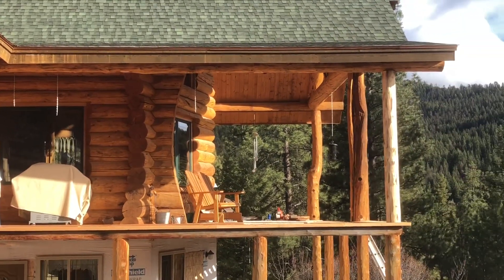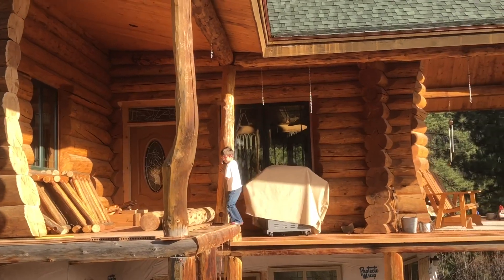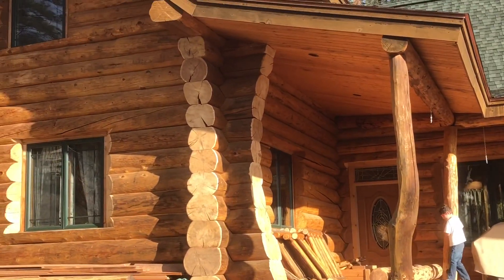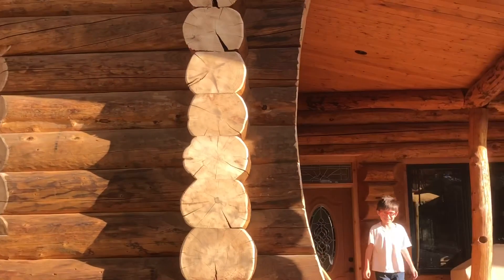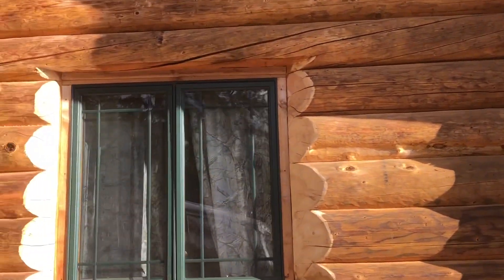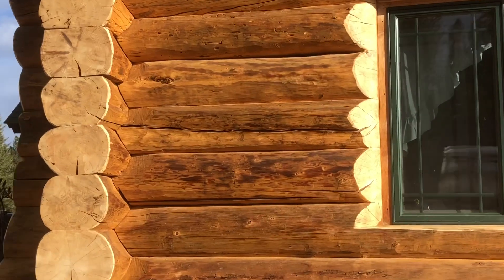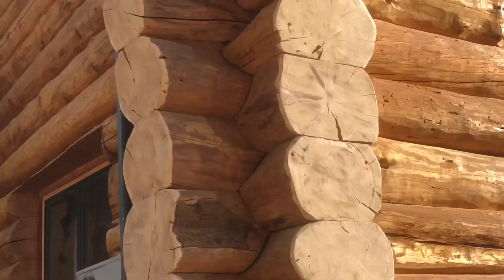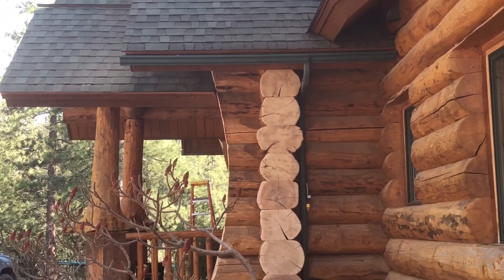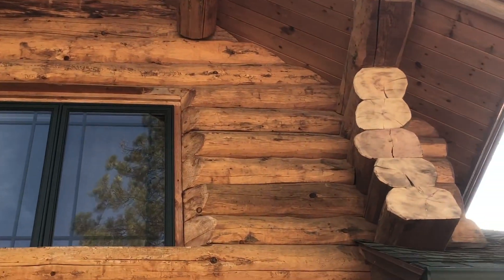We got a little bit of a start here — got that one post in and got the outside row done. We need to give this homestead a major, major facelift. It's been years since we stained it. Right now we're sanding the corners because when we media blast, it doesn't do well on the corners, so we're doing all the flats. Then we're going to media blast all the logs and give it a dark stain with a mortar-gray, mortar-white colored chinking. It's a huge project and I've been dreading it, but since we started I'm just excited to get it done.